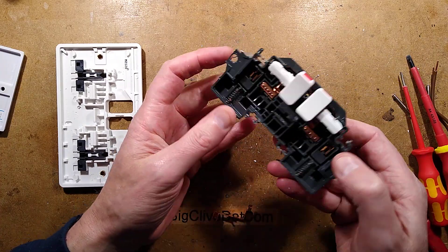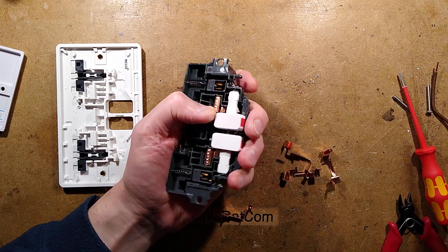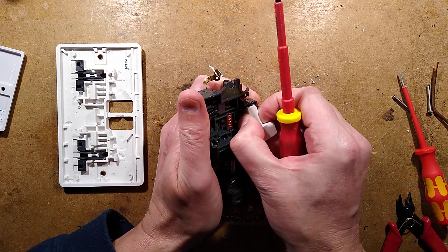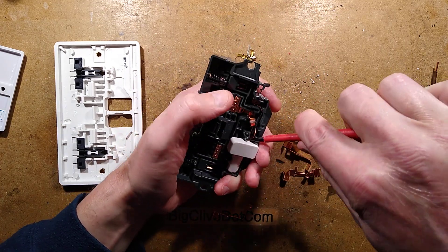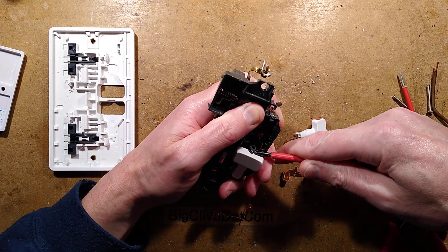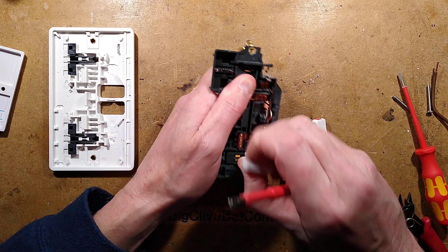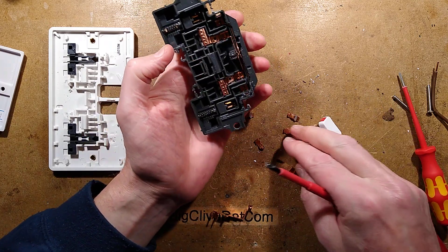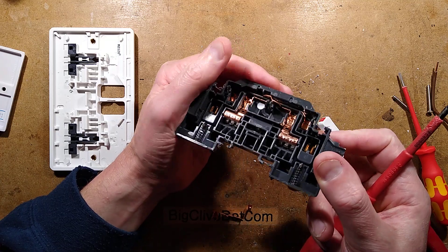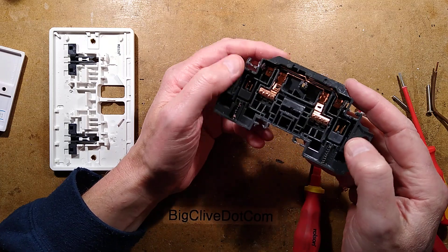What are these made of? They look like copper — I do hope they are copper, particularly given the currents that we tend to use in the UK. Not much different to the currents used elsewhere in the world, but the advantage in the UK is that at 240 volts, a 13 amp socket — which this is, which can be fused up to 13 amps and is in a ring main rated 32 amps — can deliver... well, the socket can run a 3 kilowatt appliance, but the total ring can run something like 8 kilowatts, so that's quite good.